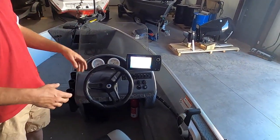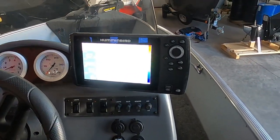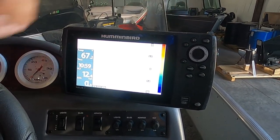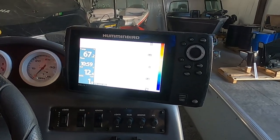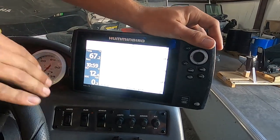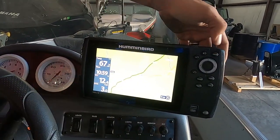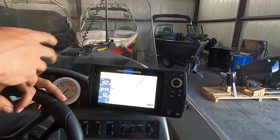Now we're going to go over the dash. An option this customer had installed was gauges — your mile per hour gauge on your right — and he also installed a Helix 7 sonar. The plus and minus buttons adjust the sensitivity, and that's one thing I find a lot of fish boaters don't realize — you do need to adjust the sensitivity depending on which lakes you're at and how deep they are. You can also change your view — you've got sonar, sonar zoom, big digits showing temperature, time, battery voltage, and speed, and then the GPS map. You're going to want to spend some time on the water going through the fish finder to get a good idea of what you're actually looking at.